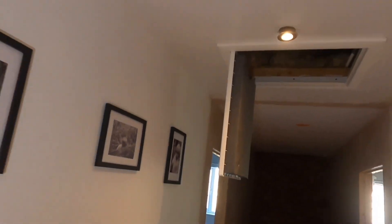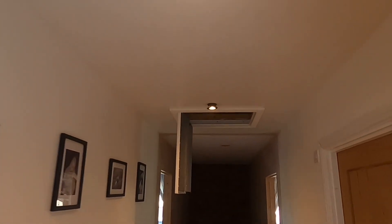So the plan is to carry on - I'll turn these on. A couple more lights going down the hallway, I'll be checking where the studs are with my stud buddy. We also want a couple of lights in here. I've come in after the plasterer so I've got to find where that switch goes and find where that double socket is - a gamble to see if it's in the wall. We need to split these lighting circuits because basically these were all one room. The lights closest to the wall are fine, they work. Yeah, we've got a bit to do so let's get cracking.